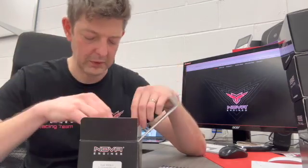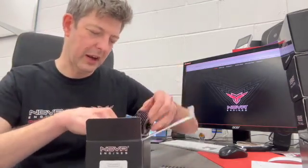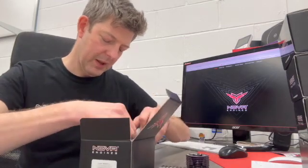It's a nice touch to include it in the box. I know some brands don't include it and instead tell you to run a slightly cooler plug to get around the change from 16 to 25. I've always been of the mindset that the easiest and best way is to alter the shimming and to alter the burn rate of the fuel.